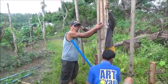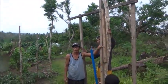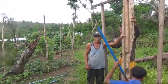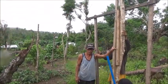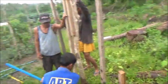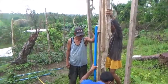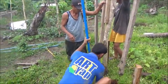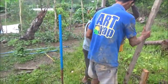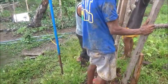Tatai, if we can, leave this one about 2 inches higher than this one, so that the panels are like this, a little, just a small amount. Not level. I want them like this, like 2 inches higher on this side. I don't know what angle that's going to give them, but it will pitch them a little bit more correctly. I mean, the whole reason for this is to keep them at the best angle to the sun.